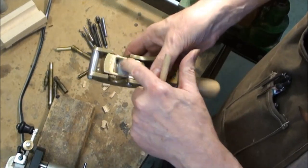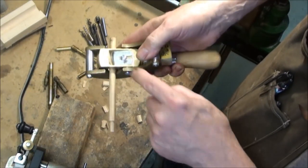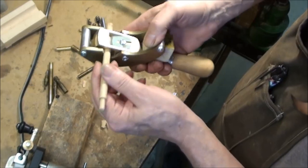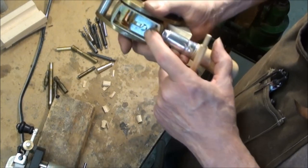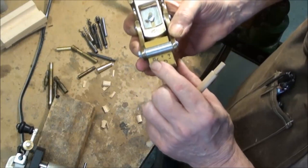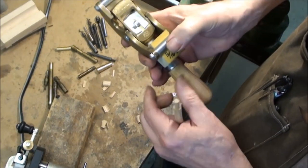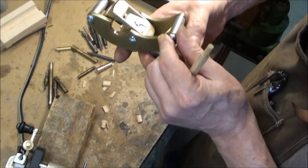They come with a blade set up here. You can see the hole here that the ramrod, or the dowel, would go into. And just like a plane, as this rotates, it's going to actually shave bits of wood off the top of this. And it even comes with an extra blade on the backside. And he's got various stops for these for whatever diameter you want. This one's 5/16. And you know, if you're doing a tapered rod, that would be the minimum size, and then you kind of just release pressure on this, and as this piece goes up, it's increasing that diameter.